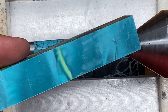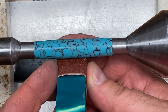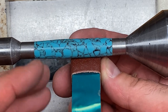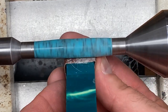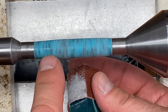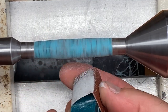One of my favorite ways to sand is to take another blank with a nice flat surface, wrap sandpaper around it, and then sand the blank. This flat surface allows me to get a nice smooth surface on the blank. This is great for acrylic blanks — it even works on wood blanks, but I primarily use it on acrylic and things like truestone. As you sand, take a look at your scratched-up areas versus your shiny areas. When I'm done, I'll know because the entire blank will have a scuffed surface, and that's what I'm working toward.